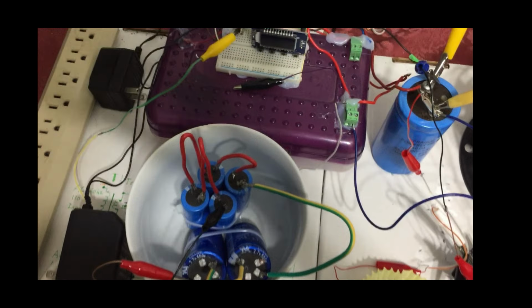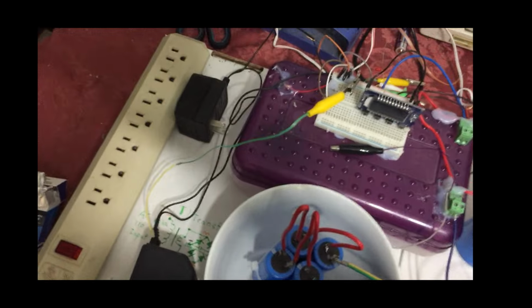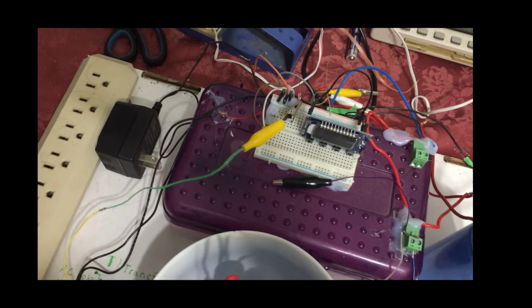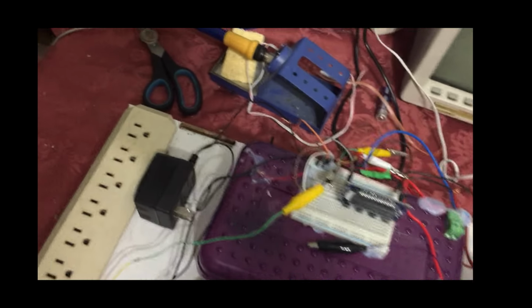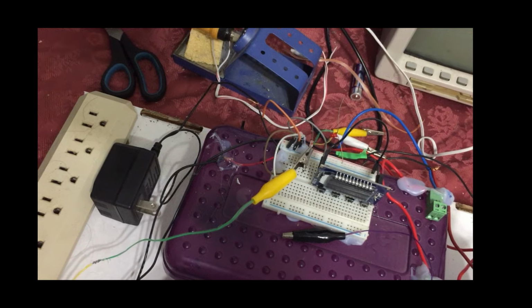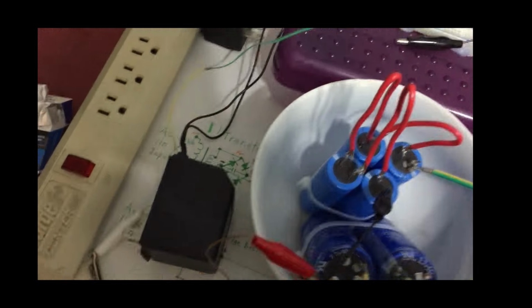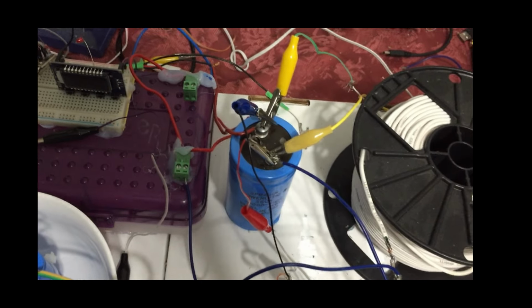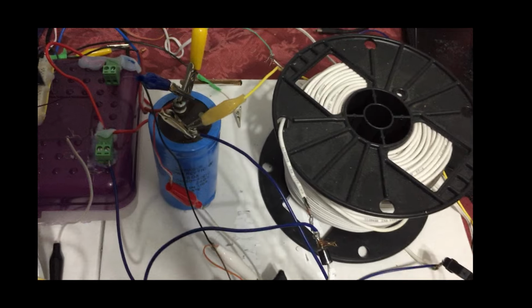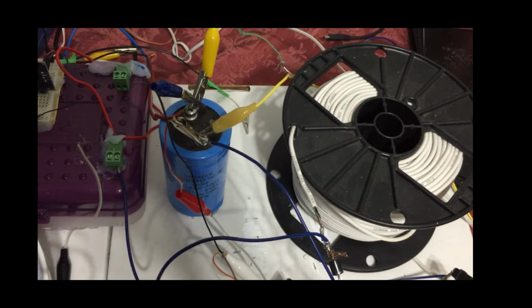Right, so now what I'm trying is I took out one of my old Bedini solid state units where I had the trigger, which was the controller basically, and the trigger isolated on their own power supply here. The controller being around 40 mAs, and this other power supply here, 18 volts, charging this capacitor. And I noticed in the previous videos that pulsing the charged capacitor into the coil yields much better results.